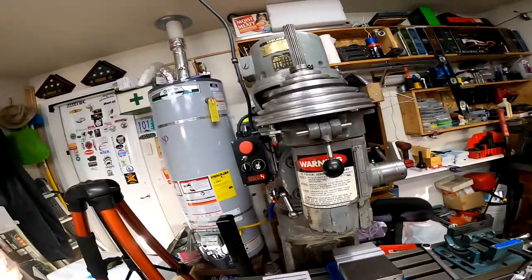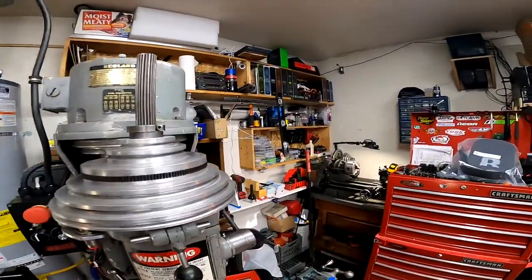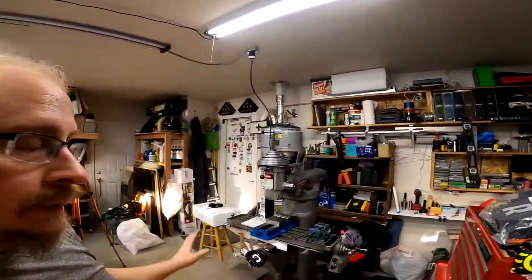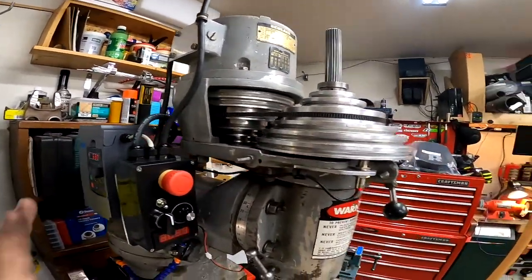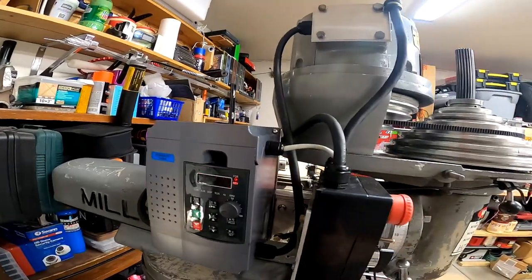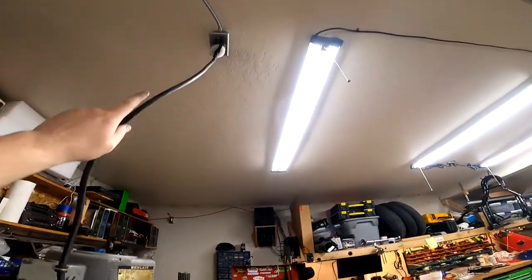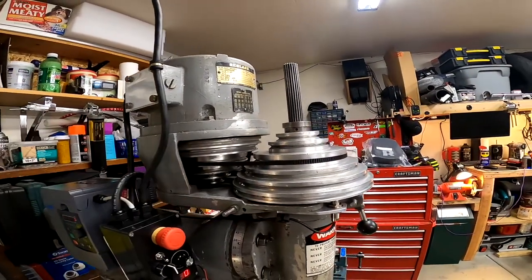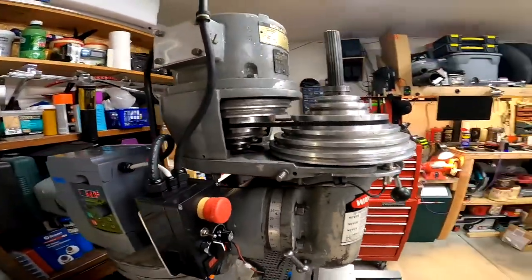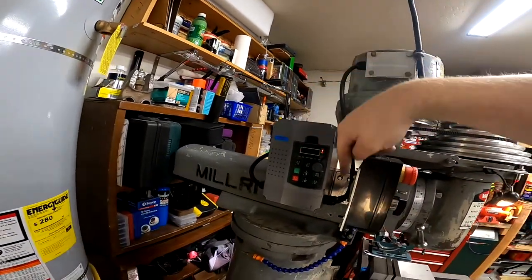So that's where we stand now. In the time that I've been working on it, since it was sitting out front of the shop to being in here, I built this bracket to mount the control box here and the VFD here. And then put all the gland nuts in and all the cabling. So it's a twist-lock up there, and I've got a strain relief there. It goes into my emergency off here, and then from there into the VFD, and then from the VFD up to the motor.